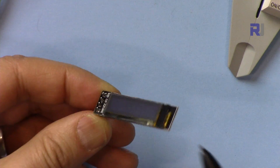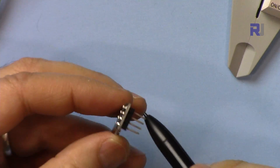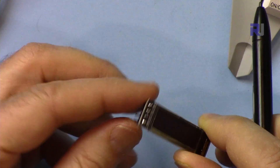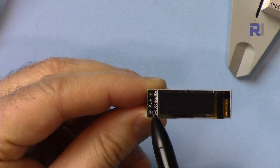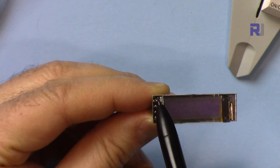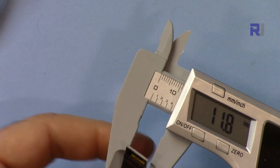This is the module — as you can see it's very tiny. You don't need to do any settings; it has just four pins. You might receive it with the pins not soldered, so just solder them. In my case it arrived already soldered. It has four pins: Ground, VCC, SCL (that's the clock), and SDA (that's the data). It needs one more pin called the reset pin, but that has been handled in the code.